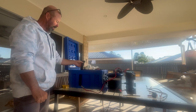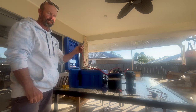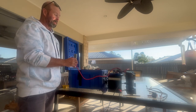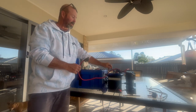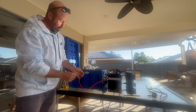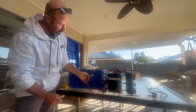The battery strap is in. Now we're going to work out where this Anderson plug's going in. I use the Anderson plug for running my electric motor and charging the battery — whatever else an Anderson plug would be used for. It runs straight off the battery and it's got a 60 amp fuse on it. I've marked the hole out and that's where I'm going to cut it.